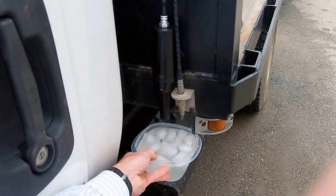Step two: place the ice bath directly under the sensor lens. It's okay to have someone hold the ice bath steady under the lens if that's easier than placing it on the ground surface. The Surface Patrol probe should be powered and allowed to run for at least 20 minutes in the environment where the calibration is performed before starting the calibration procedure.